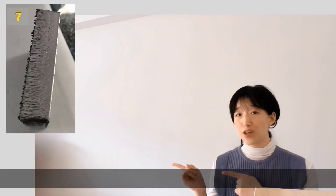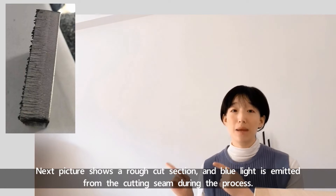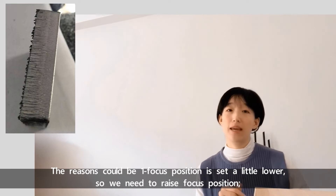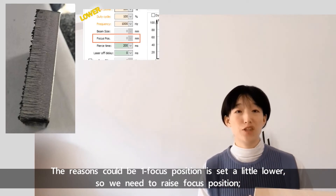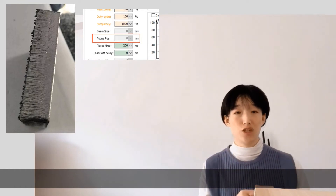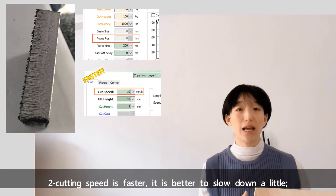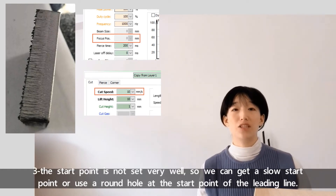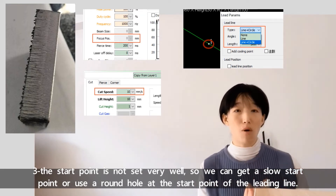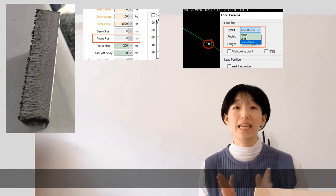The next picture shows a rough cut section and blue light is emitted from the cutting scene during the process. The reasons could be: number one, focus position is set a little lower — we need to raise the focus position. Number two, cutting speed is too fast — it's better to slow down a little. Number three, the start point is not set very well — so we can set a slow start point or use a round hole at the start point of the leading line.